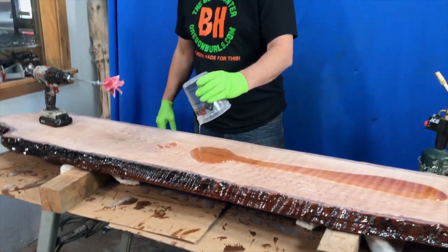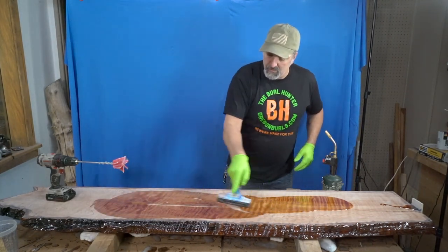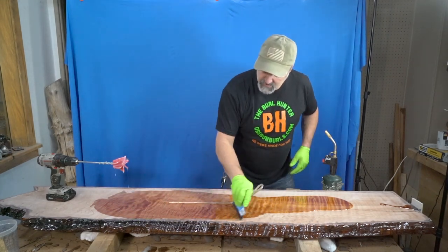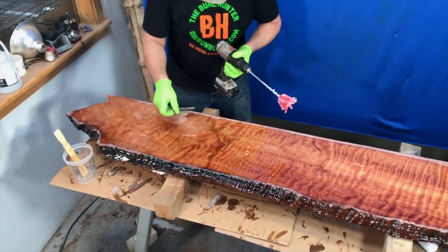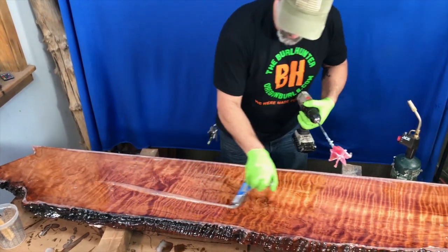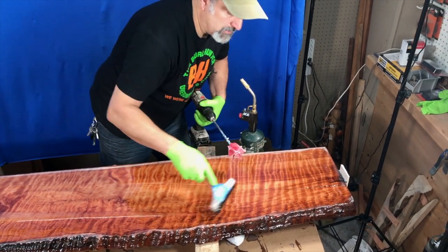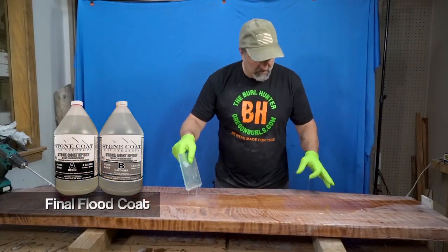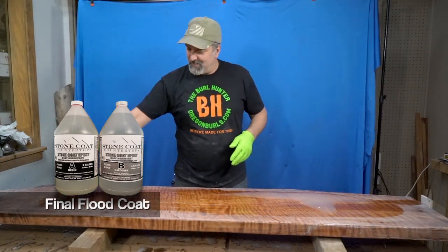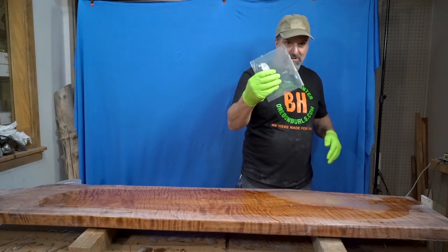What I'm doing is just mixing it right now, making sure I got everything. I don't want to go over the edges on this — I'm just sealing the wood. Even this thick epoxy soaks into the redwood. Don't want to heat it up too much or you'll get a lot of little bubbles. I don't have one of Mike's Stone Coat trowels so I made my own out of plexiglass.